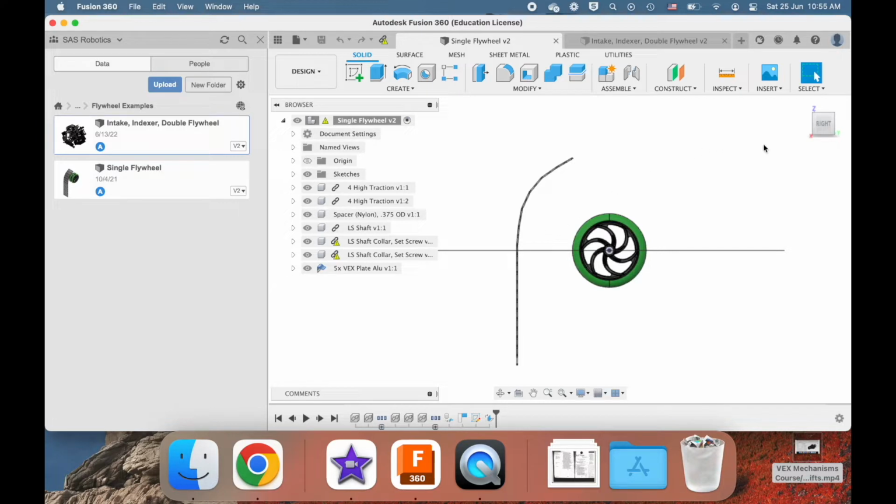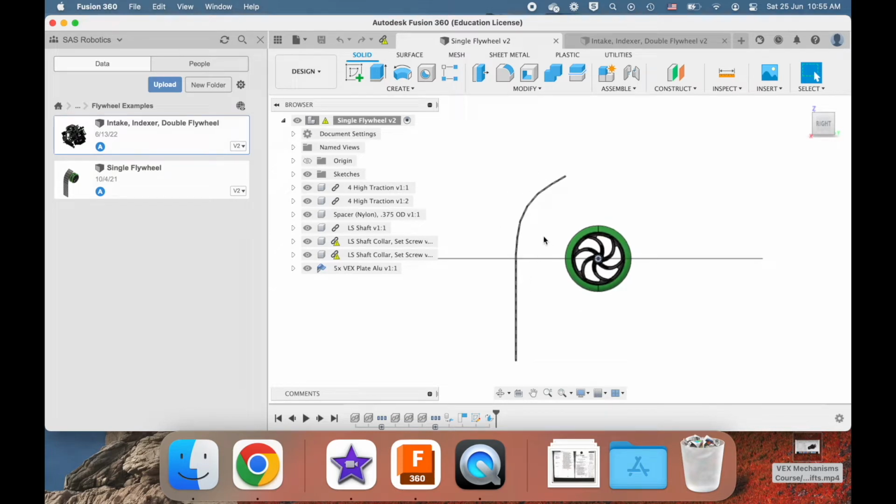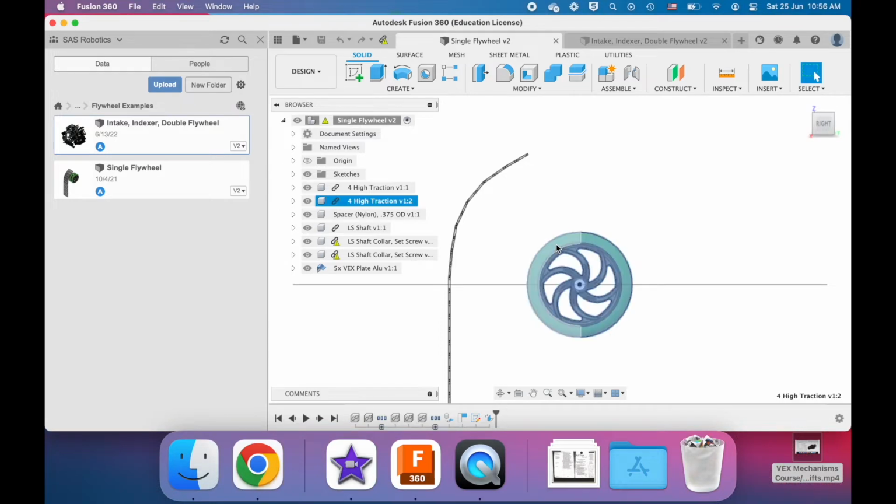at this arc or trajectory, right? But something that's arguably better about a single flywheel is that when you vary the speed of it, you have a bit more control of the trajectory of the game element. You're able to better control different trajectories of the game element, because when you fire the projectile, you always create some kind of spin with a single flywheel, because the game element is having to roll off the back wall of a single flywheel. Okay, and this is a vertical single flywheel, while it's just making contact with this wheel.